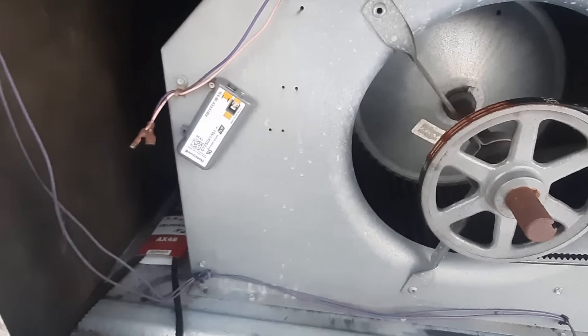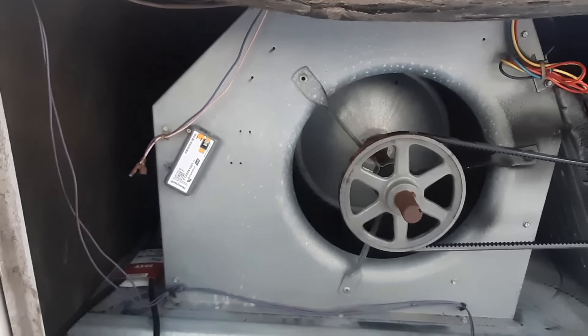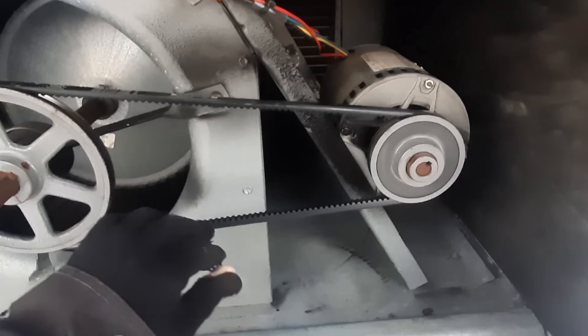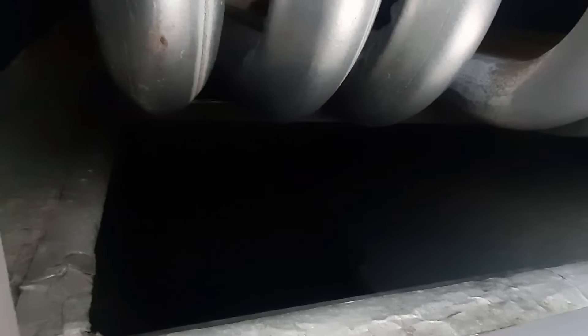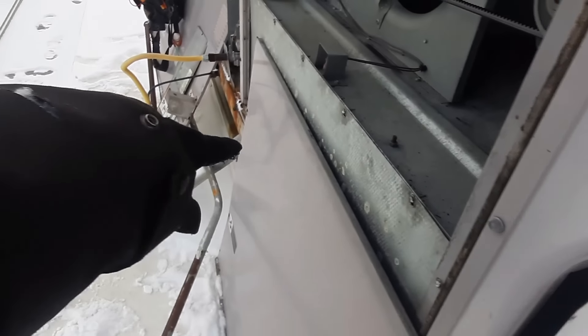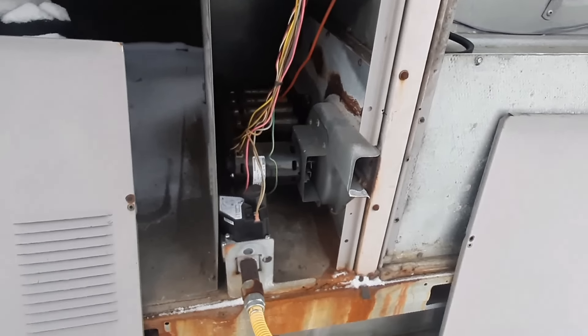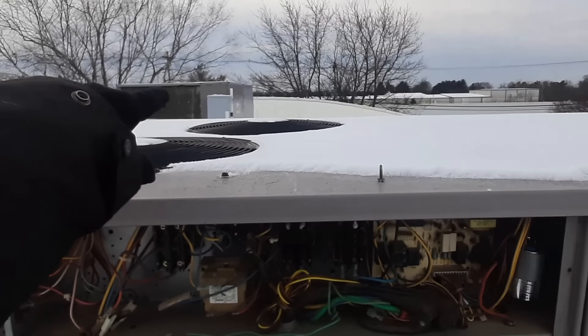Looks like somebody's unhooked something. I see a temperature sensor but no JADE economizer controller. The belt's in good shape and it's tight. I don't think the blower was running at all. That heat exchanger looks bad - it looks like maybe this one got changed a little before where I did the other one. I can see some rust up there on the header. That's probably going to have a small crack up there by the header. We'll have to get in this side, but I need to get the heat back running right now. The way the front plate looks, it's all going to have to go.